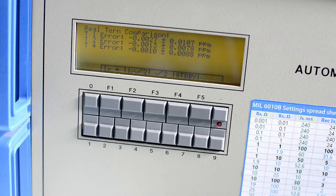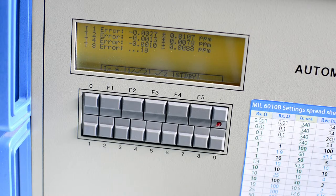And there is a further evolution of DCC bridges for metrology labs. For example, here we were talking about your measurement being as good as your standard, the one that you use as a known value resistor when doing the comparison. But how can you get very good values down to ppbs for the standard resistors? And the answer to that is using a cryogenic comparator bridge, or CCC. So that's essentially the same thing, but instead of a nanovoltmeter and a magnetic flux detector, like in this bridge, the cryogenic comparator uses superconductive quantum interference devices, or SQUID, which is also a cryocooled, super sensitive magnetic flux detector.